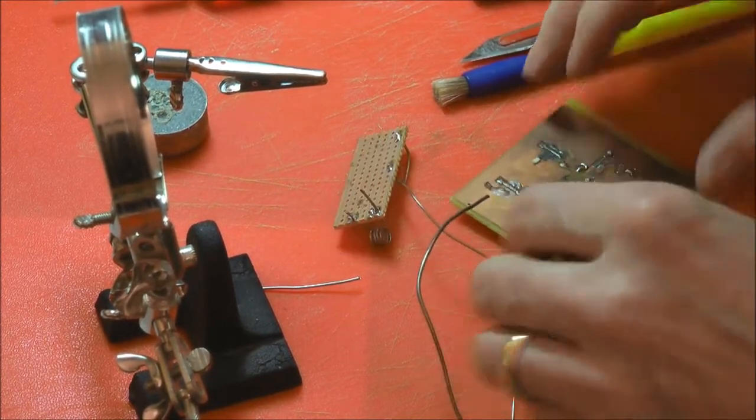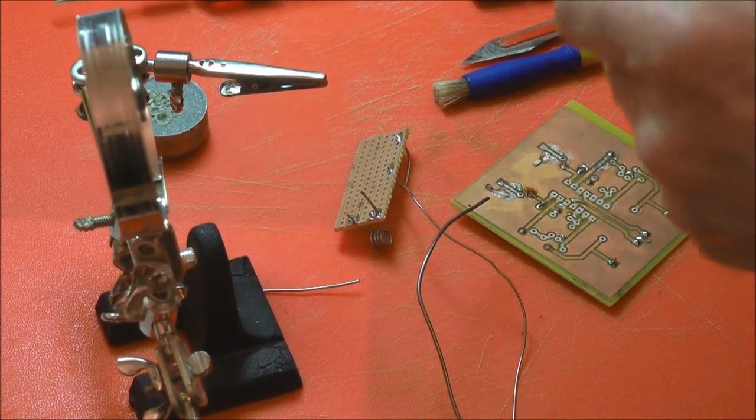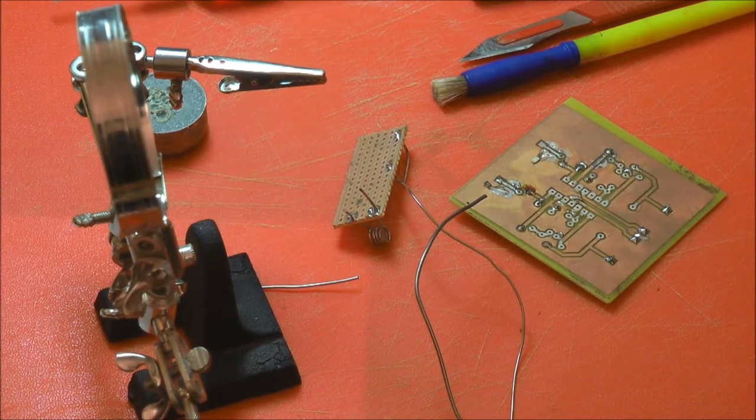So one of the things that's important is to produce a mechanical joint rather than just hold it and solder it. So anywhere where you've got a hole like that where you can put the wire through and clinch it over, so it's self-supporting, flux it and then solder it, or make sure the things are clean. I think you've got to do that sometimes. When you've got multiple conductors coming into one hole, you've got to bend. You've got to really capture them before you do it.